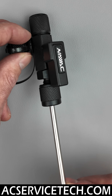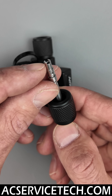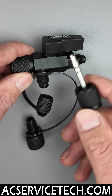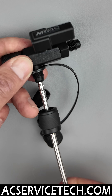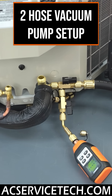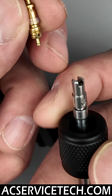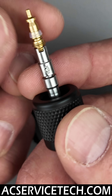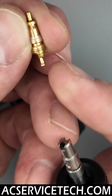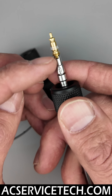You have this rod here on the back, and you can disconnect it. I do like this style of the kind of mouth in the front right here. When I use valve core removal tools, I typically am removing the valve core out of the side. You can see it's grabbing a hold of the end of the valve core — it's not necessarily tension-fitting this little rectangle, because some valve cores have different size rectangle shapes. This is just grabbing on the end, and I actually prefer this style.